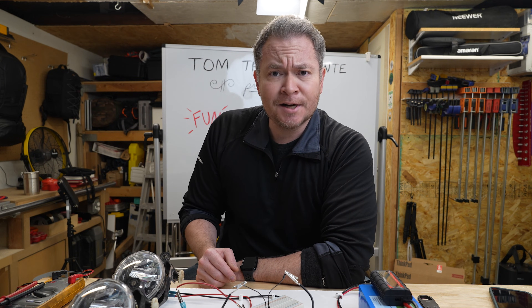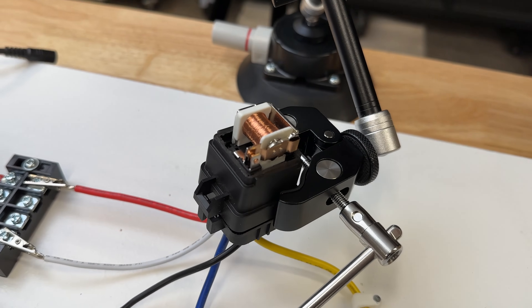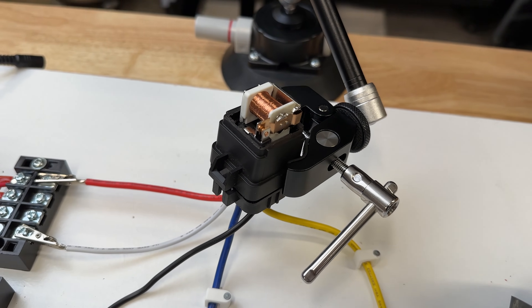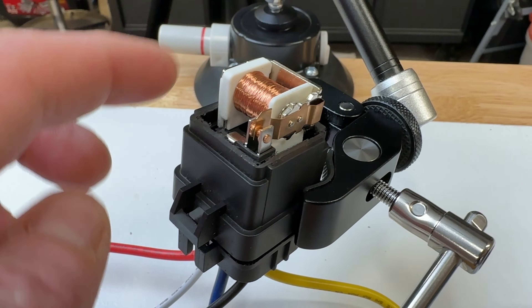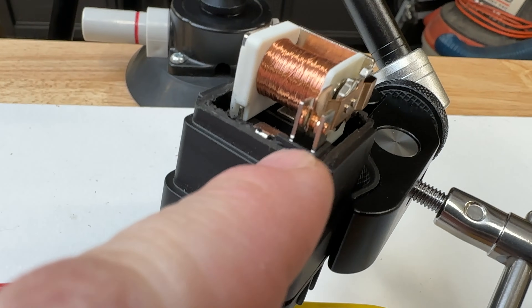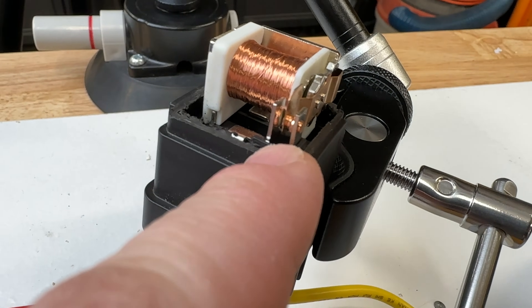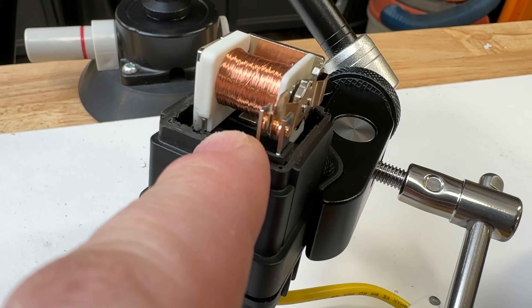Next, let's take a look at what's actually going on inside a relay. As you can see, the inside consists of little more than a couple of terminals, an armature, and a wound coil that is used to activate the armature. The lead from the battery comes up through this main bar where it goes to either of these two terminals. This terminal is associated with the yellow wire, or the normally closed position. This one is associated with the blue wire, or the normally open position.